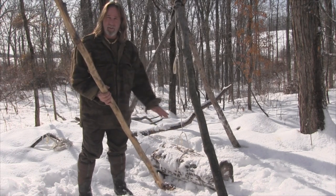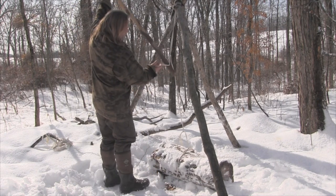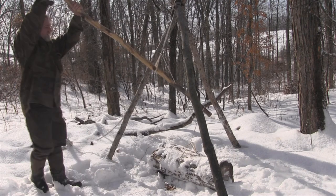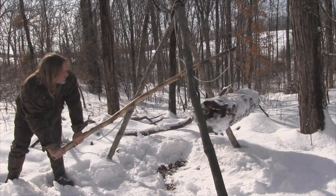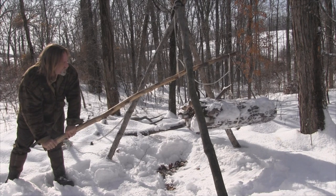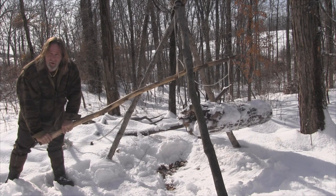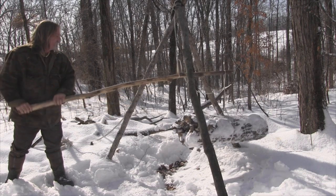What we're going to do is come in through the first loop, go down, then come into the second loop, and simply turn this against itself and pull down on the lever — that will pick the load up off the ground. We can now swing that load to anywhere we need to in this general area, or just lift it up to put something underneath it where we need to roll it, move it, cut it, or something like that.